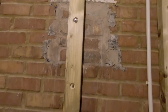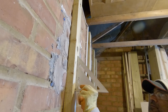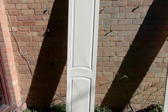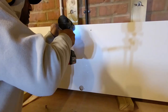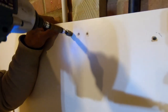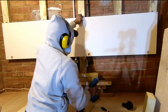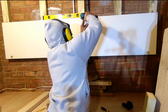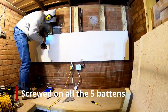Next I used an angle grinder to grind off the excess bolt so there's nothing sticking out. For the backing I'm going to reuse some old salvaged wardrobe doors which are about half an inch and appear to be MDF. These are going to get screwed onto the battens — three screws at the top and three at the bottom — driven directly into the battens. This spreads all the load across the five battens, with a total of around 30 screws holding it together.